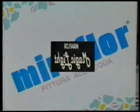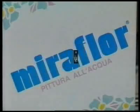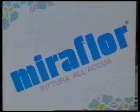Miraflor Magic Light is a decorative finishing coating which becomes luminous when it is exposed to Wood's light or any other source of light. Due to its capacity of retaining energy, it gives magnificent light effects even in total darkness. Its applications may be varied, for example, private or public buildings, discotheques, exhibitions, or marking off safety zones. Tools used for the application of Miraflor Magic Light are cleaned first with water and then with white spirit.